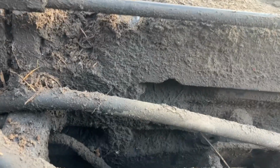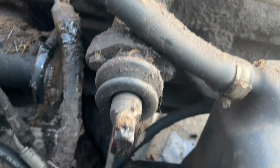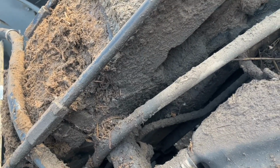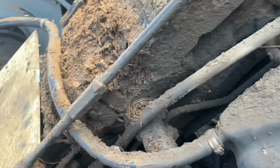But yeah, tomorrow we'll open it here from this joint here, just at the back of the gear stick where it goes into the range box, and we'll lift all that out then, and we'll go in through the front. We'll take out the PTO and lift pump, and we can get in then at the pinion.